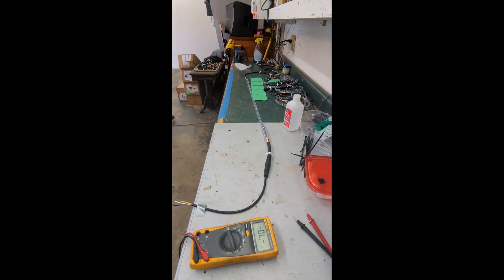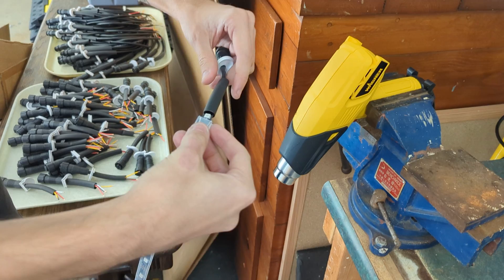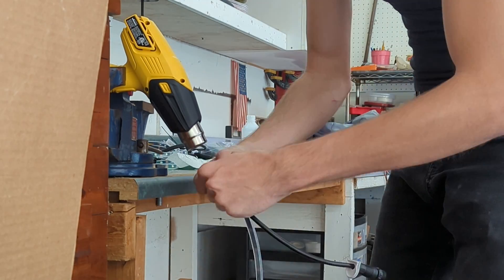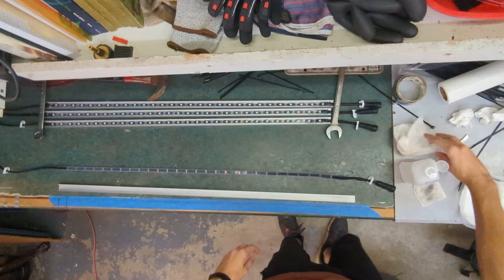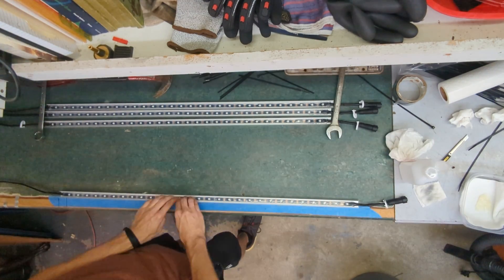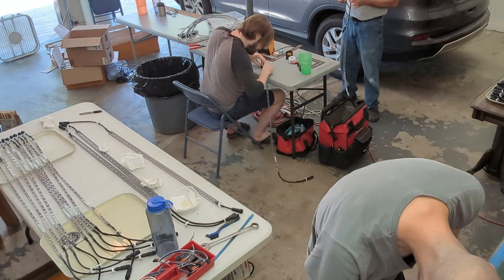We would check the electrical connections and then run it through a test bench using Arduino to make sure all the LEDs lit up in sequence and that all the LEDs were showing the proper colors. Step four: once the connections had been tested, we sealed the ends to make sure they were weatherproofed since we knew this display was going to be living outside. Step five: we took our LED strips and glued them into the aluminum channel so they wouldn't shift around after being installed. That was our production process — now we just needed to repeat it 180 times.